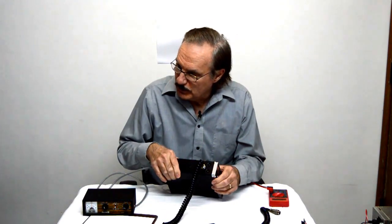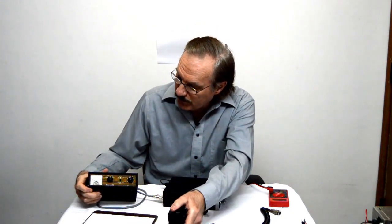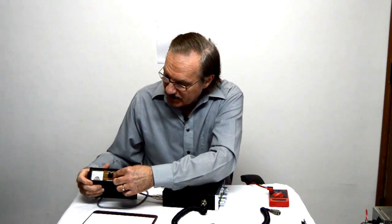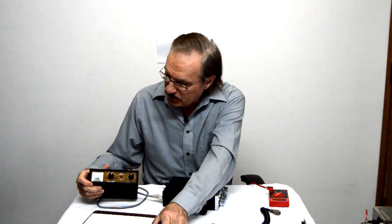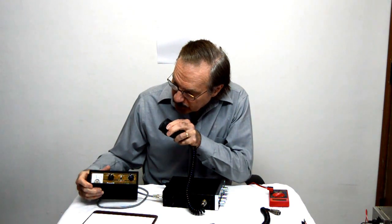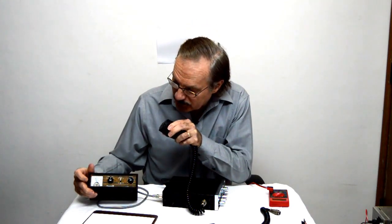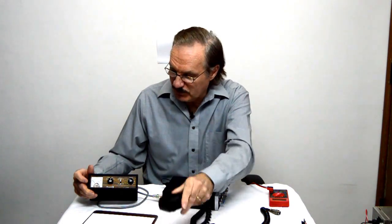Well, I can hear something. Let's key that up and find out if we got it. Well, we got power, so that's working all right. Let's switch this over to modulation. And we'll set that modulation meter. That looks good. And then we'll talk in there. Hello, audio. Well, we got a problem. Okay, you see that needle? It's sitting still. That shouldn't be sitting still. That should be moving with my voice. So this microphone is not correct for this radio.